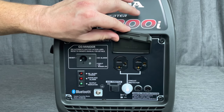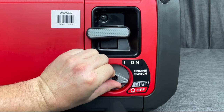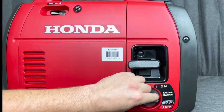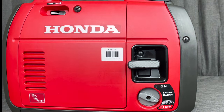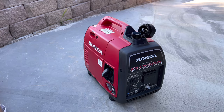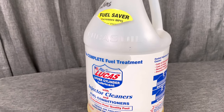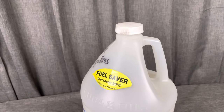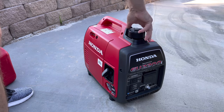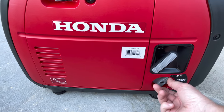This is a 15-amp rated generator and it comes with 110-volt outlet plugs that are actually pretty good quality. Another added feature is a fuel shutoff switch — pretty standard on most new generators. When you put it in the shutoff position it drains the fuel out of the carburetor, making it excellent for long-term storage. While fueling up, it's a good idea to add a fuel treatment or conditioner — I like Lucas products, though I'm not sponsored by them.